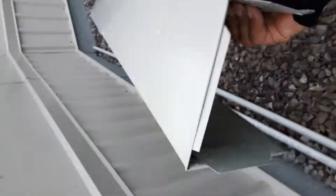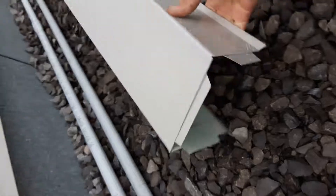Hey, what's going on, it's me again. Yesterday I showed how to bend those S-locks and cut them. The caps are bent and we're going to put them on. Here's the S-lock I'm talking about — see how it's bent there? We bent the caps down to make it fit with an angle on it.